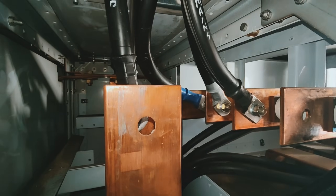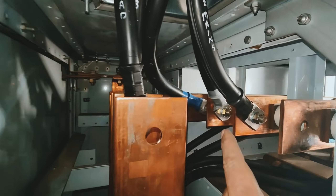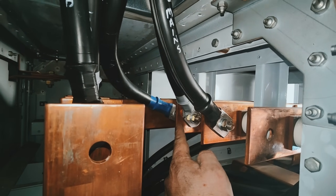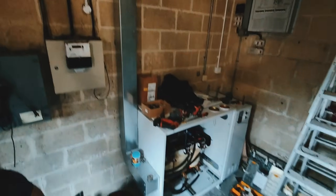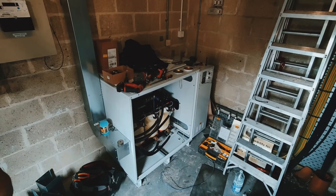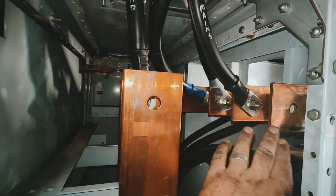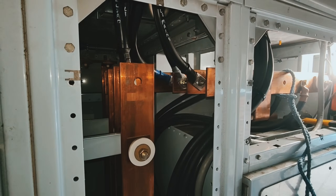Right, so we've been working - obviously the power's off so we can't be standing around filming and chatting. We've got mains L3, L2 - obviously L1's going over there - they go over in the trunk and right the way around, over there, down onto the top side of the optimizer. From the bottom we come back out in the same trunk and all the way over onto this side. So you can see: load L3, L2 load. We're going to put L1's on and essentially that is it - that is the job. We can turn the power back on.